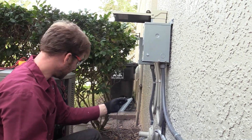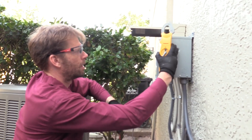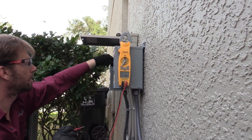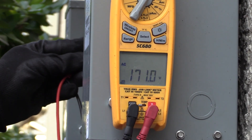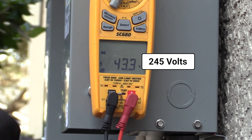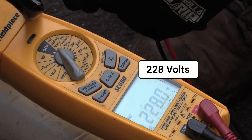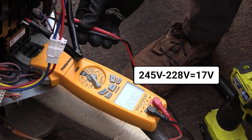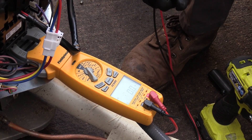Which leaves my other high voltage line — the line side — with X1 and X3. That's all I have left, and that's correct. It's about as simple as that. I have an access panel you can close up, but first I'm going to test my voltage in and out to make sure we've done the job we're supposed to do. I have 245 coming in and then coming out of the buck and boost, 227.